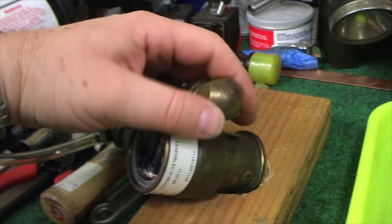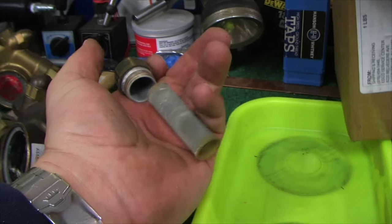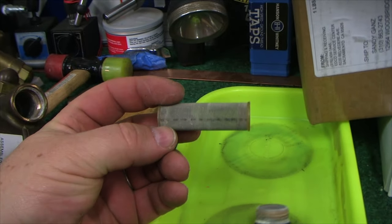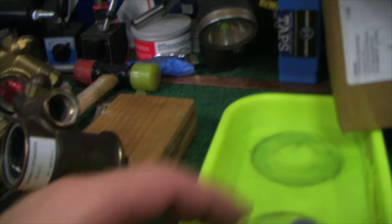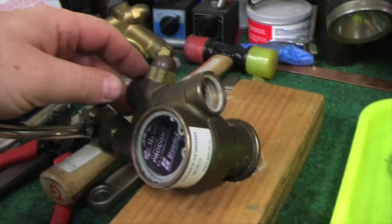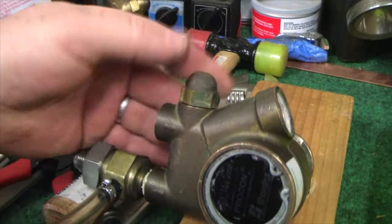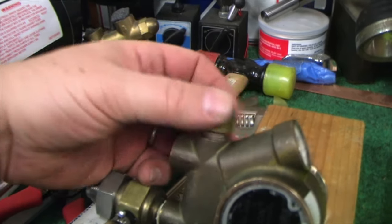This is the place where you would find, if it's still in there, the screen filter. If you're going to do this as a welding TIG torch cooler, it's a great piece to have in there to protect the input of the pump. You can see a little calcium or scale or lime buildup in there.